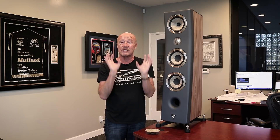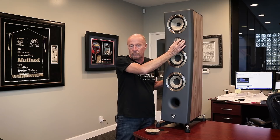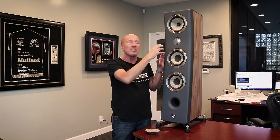What else do they do? Poron. Around the edge of the tweeter they use a special suspension. Tweeters can actually degrade over time because their suspensions can become hard. Poron does not do that. It's a DuPont material. It lowers the resonant frequency of the tweeter, which means it doesn't break up. By doing so, they don't have to do any tricks in the crossover to eliminate that resonance. Crossovers can be your enemy, and what Focal has done is make their crossovers less oppressive.